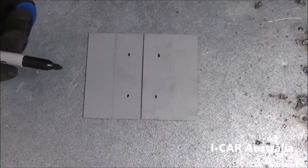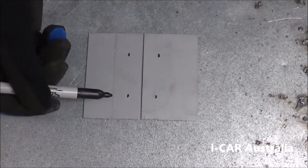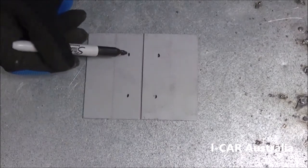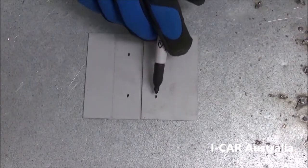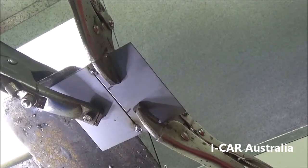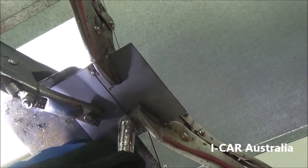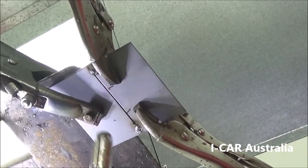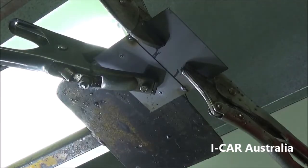The biggest issue is the heat pushing the backing plate away from the joint. To alleviate that, you will need to clamp with vice grips deep into the sample. Mark your maximum weld bead length. A good tip on this sample is to turn the gun around, use your thumb on the trigger, and travel towards yourself for a continuous weld.